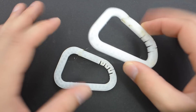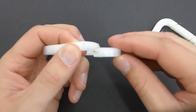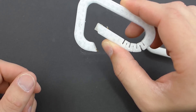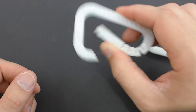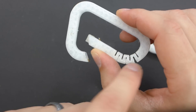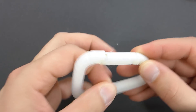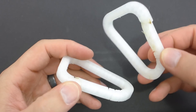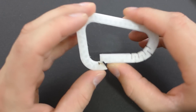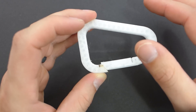Lately I've been obsessing over carabiners. This first one had some pretty serious warping — it didn't go very well. But it does actuate; other filaments I can usually get a good actuation, though the joint is what usually breaks. So I reprinted it with better settings — added a little more glue stick. This one came out perfectly flat, really nice. It actuates well. There's a little crack in there, but it goes almost all the way back without issue. Not too bad at all.